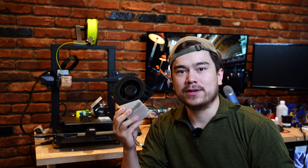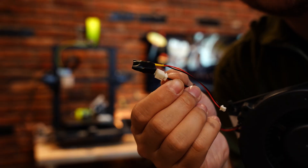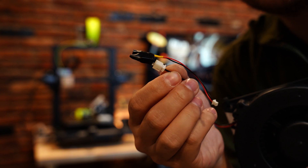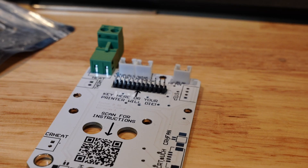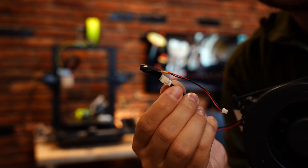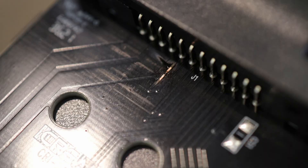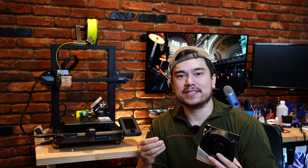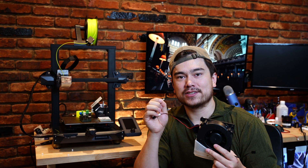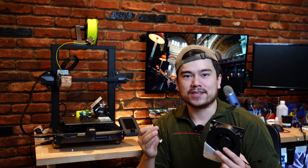For example, if you wanted to upgrade the old part cooling fan to something new that'll provide a bit more cooling power, you have to solder these tiny connectors onto your fan before you can plug it into the board. I've made a little adapter that lets you go from the tiny connector up to the normal size connector, but why not just put this standard size connector on the board to begin with? That'd make things a lot easier, and you wouldn't have to come up with janky solutions like this. Also, while you're working on these fan connectors, if at any point you short them together, it'll completely fry your breakout board and you'll lose the ability to use that fan. I think that's just a bad design choice on Creality's part, because these small connectors are harder to work with and easier to accidentally make shorts with, so it really makes things more tedious and complicated than they need to be.